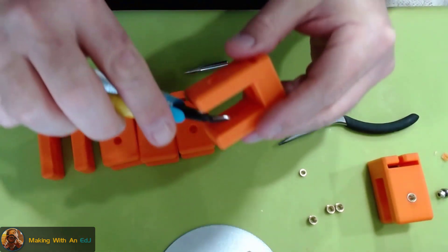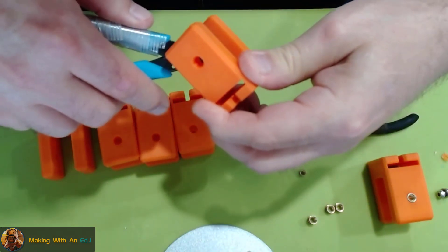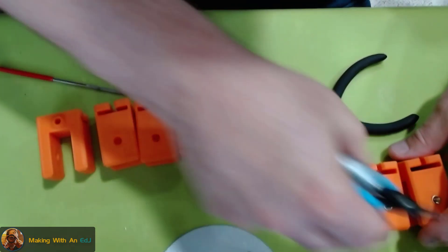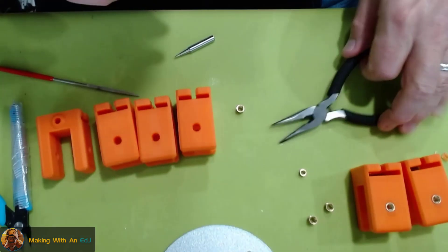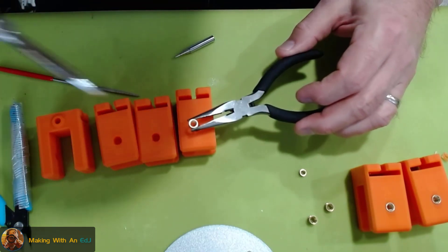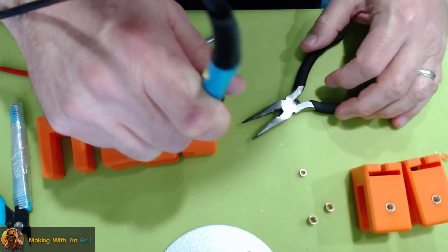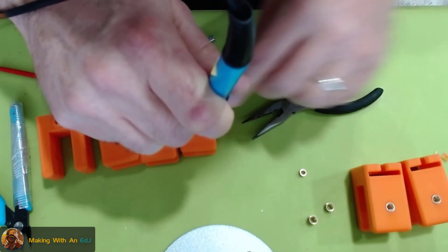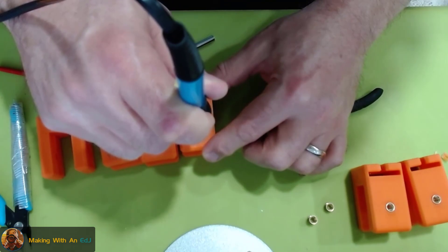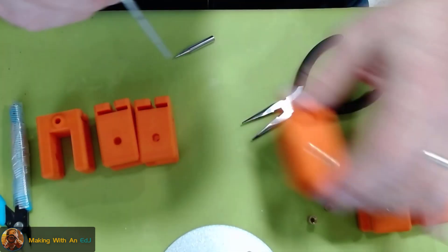Before doing the second one I'm going to see how it works — it looks like it'll probably be okay. Now I'm going to do the same thing with a 6-millimeter insert. I'll also mention: when I modeled these holes, I put a little half-millimeter chamfer on each one to help it stay square when pushing it in. That one is in, and I don't see as much flashing on this one, so I'll set it aside to cool.